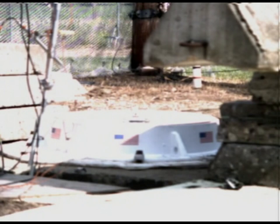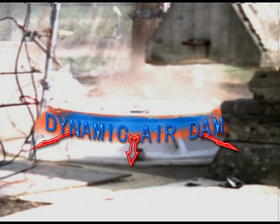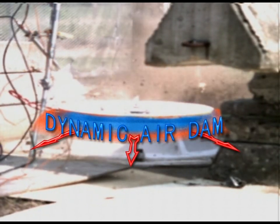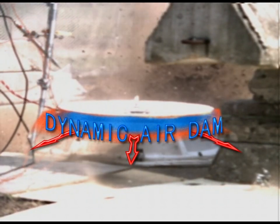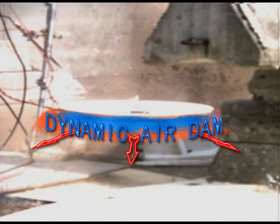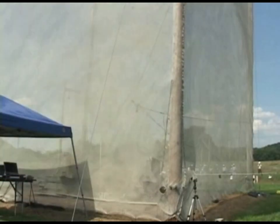As the gases swirl and tumble within the defined space, they are diffused and increased in pressure, where they form a dynamic air dam. The air dam allows for controlled pressure release of the exiting diffused gases, while simultaneously preventing the incursion of fresh oxygen into the manhole vault, thereby eliminating the more massive secondary explosion.